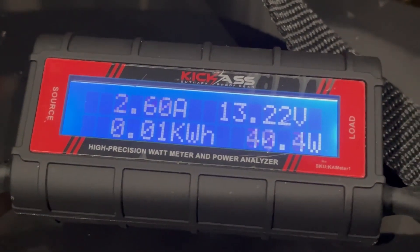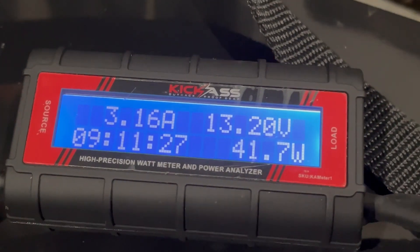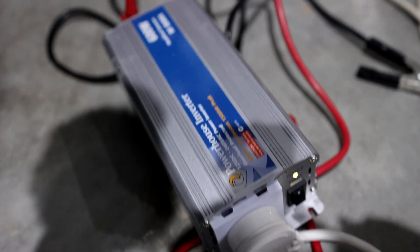Quick check-in: we're still drawing two to three amps. It's been going for nine hours and we have used 27 amp hours. I needed to speed this test up, so I've got some sanders and an old inverter that I had lying around. Now with these sanders going, we're drawing 31 amps. It was just taking far too long. It's close to 19 hours now and we've currently used 63 amp hours.